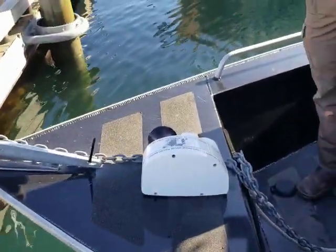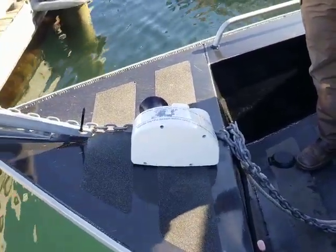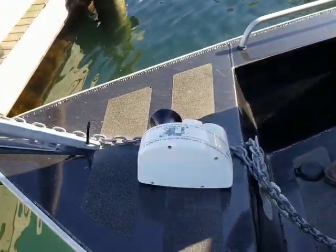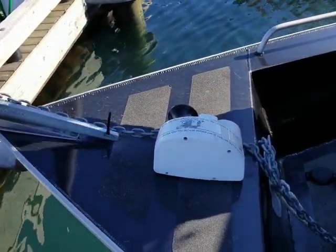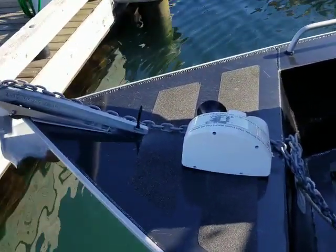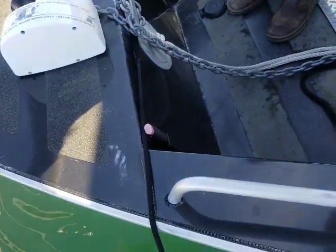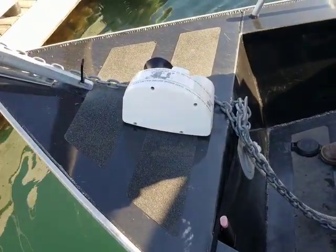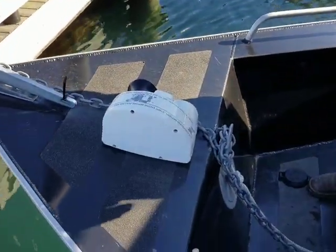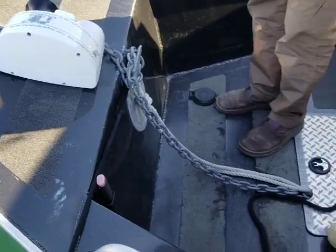dangerous thing people do in Cook Inlet. Cook Inlet's got the big tides. There's stories about people dropping anchor and it starts to pull the boat under. This is a bigger boat, we wouldn't expect that to happen, but we keep a dedicated anchor knife up here all the time, and if you get in trouble with the anchor, sometimes your best odds are to cut the anchor line and just start over. There's about 300 feet of anchor line and about 20 feet of chain.